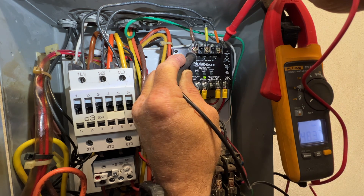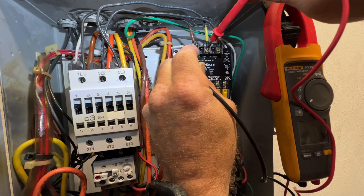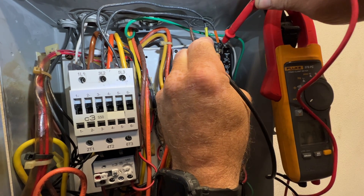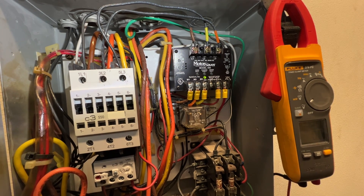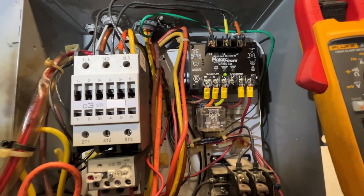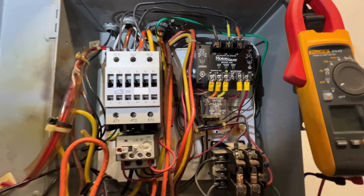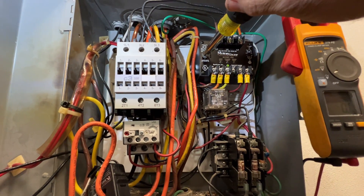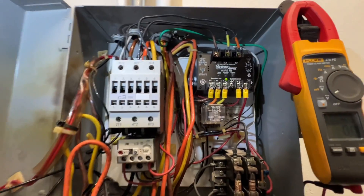483, 483, and 478. Let's do the math on that balance - pulling out the calculator. It looks like the average is about 481 volts. It's not even a half percent unbalance. So we can leave it or drop it down - I really don't want to be changing any more motors, so I'll set it at 2% and see how it behaves.